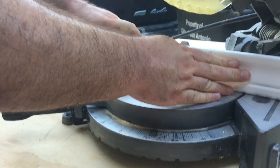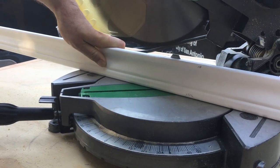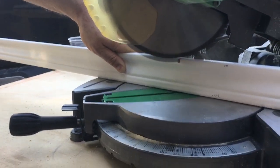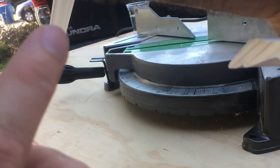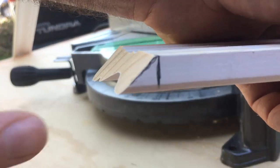I like to put a little line there as a mental note that my saw needs to end at the very back of the board. Watch your thumb — right at the back of the board — that's how you want it. Then go ahead and get your first piece in so that when you cut your other boards you can line them up.